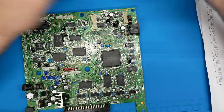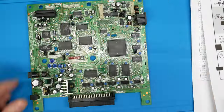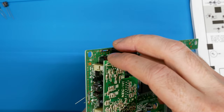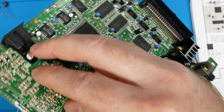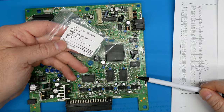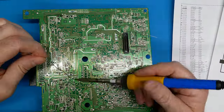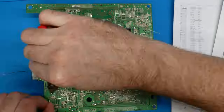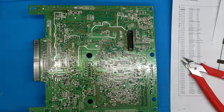Double, triple, quadruple check polarity. Now we're going back to put all the through-hole style capacitors in. We've got all the surface-mounted ones converted to the through-hole style, laid where they need to be, and we're just going back and putting all the through-hole style capacitors in their vias. Here we are test-fitting that board again — I had to test-fit it several times. You had to be creative with the way you laid them down — the tight fit. Now we're going to put that super capacitor replacement in. Once we've got all the through-hole style capacitors in, we can go ahead and solder them in, come back, snip the legs off, and give it a scrub down.